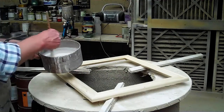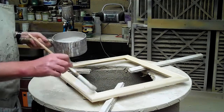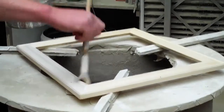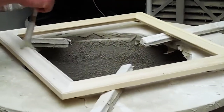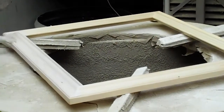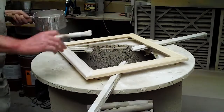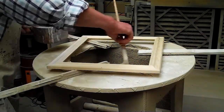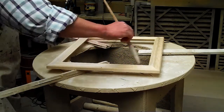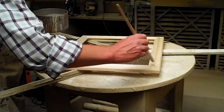Now we're going to put at least four coats of gesso onto our frame. The first coat we work in, really trying to get it into the grain, remembering to get all three sides and working it into every nook and cranny — not forgetting the back of the frame and the side edge. Each time I go into my pan I'm giving it a very gentle stir, and I'm not allowing the brush to drip into the pan — pulling off the excess up the side of the pan — trying to avoid getting too many air bubbles in the mix.